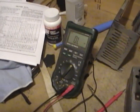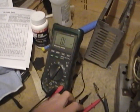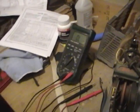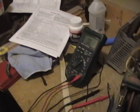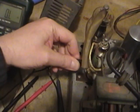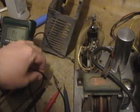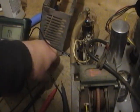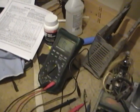Now, I did have this set fired up a while ago, and even though I discharged the picture tube, there could be some residual charge in this area. Maybe that was throwing my multimeter off. I'll hook it back up and test it one more time. Regardless, I'm certainly going to swap out this resistor for a new good one. It's just weird because I've never seen a resistor measure all funky like that.